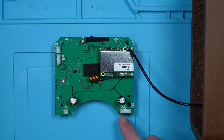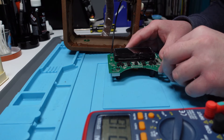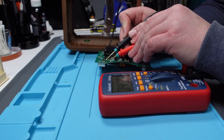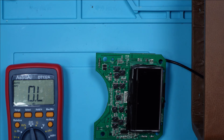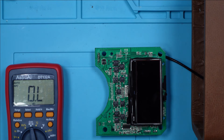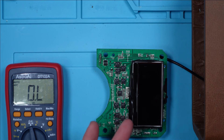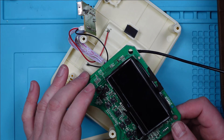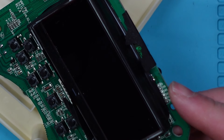And then the five or six volts will travel through to this point here through the ribbon cable, and it will appear on this side here. Then it goes straight into this little component here. What is that? A diode, I think. That diode is open — and 43 kilohms that way. I think that's okay. Let's check the other one: that's 9 kilohms, and open that way. I think they're okay. Let's just check if this switch is working, because obviously it's not going to turn on if the switch doesn't work. Yep, that works fine. I can't see anything immediately obvious with this board. I'm going to go around it with the multimeter and check for continuity between all the traces on the power line. I don't know whether you can see that on the camera — you can just about make out the display. Very, very dim.